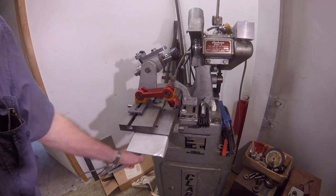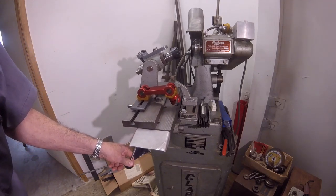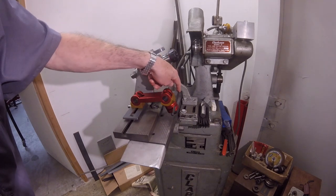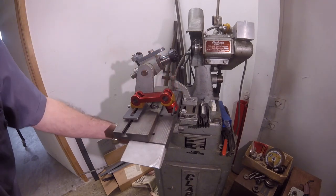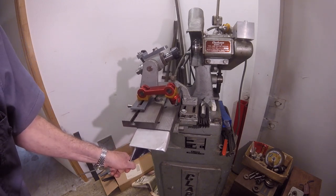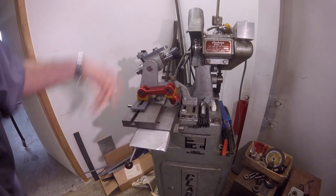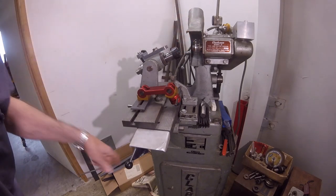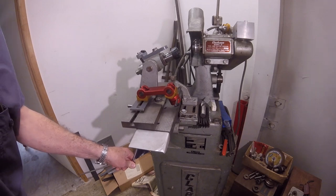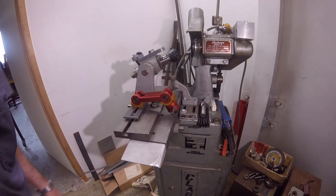You can set it to anywhere you want with the stopper bar — quite easy to use. I intend to put a thin wheel-type micrometer adjustment over the bar for fine settings. That adds one extra axis of use to the Clarkson because you can come up to a set point, and it allows you to grind up to centre with the grinding wheel. When you're gulleting or coming up to the gullet, it's very, very handy. So I thought I'd show you that before I break it down.